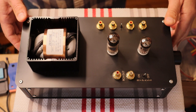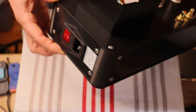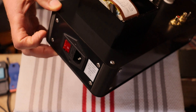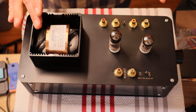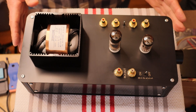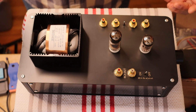Let's take a quick look at the front — there's just a simple volume control. On the back, you have an IEC inlet with your switch and a built-in fuse. You'll have labels depending on whether you're in a high-voltage or low-voltage mains region. This is a universal transformer, so it doesn't matter where you are in the world — you can wire it for either 120 or 230 volts. It's really only a difference of two wires, and there's quite a range of voltages covered.